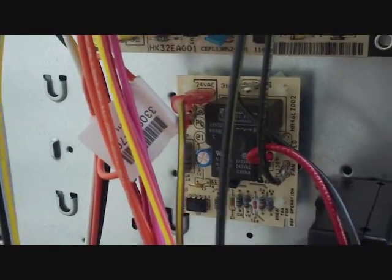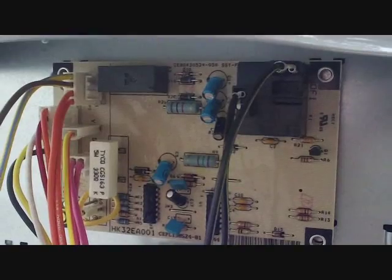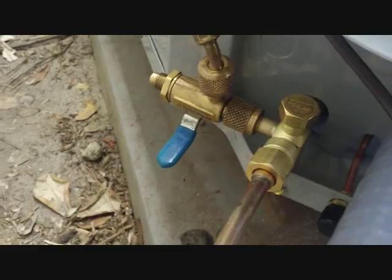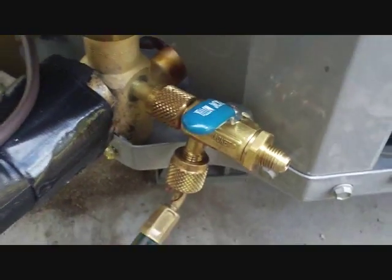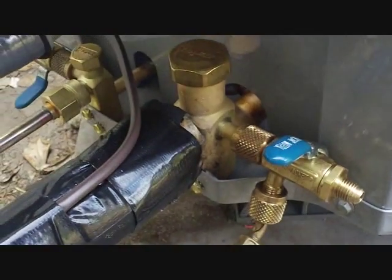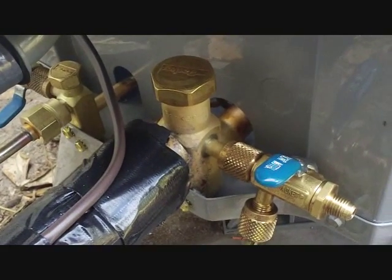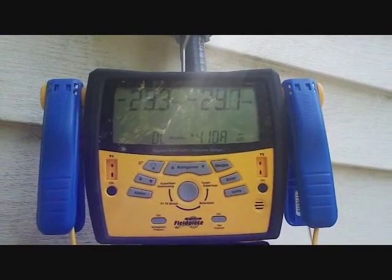Two-speed fan motor relay — I think at 82 or 83 degrees outside it steps up to high speed, and when it's cooler outside it's on low speed. There's our defrost controller. Everything's set up for the vacuum. I'm going to take the cores out so I can pressure it with nitrogen, which makes for a nice easy switchover into the vacuum. We'll see how this vacuum pulls down today and come back to check on it in about five minutes.